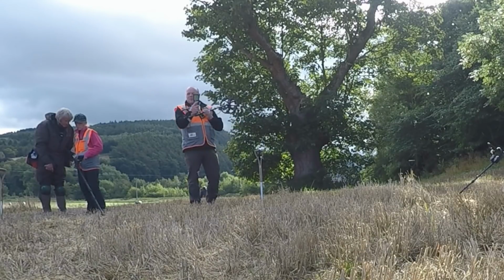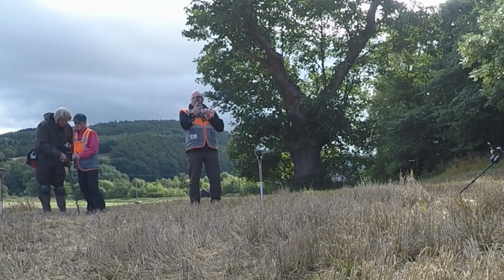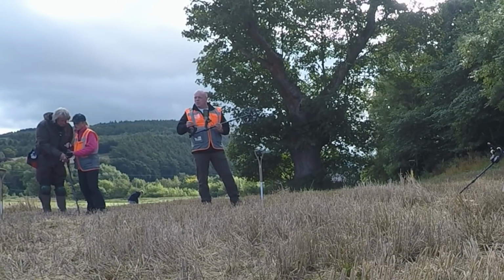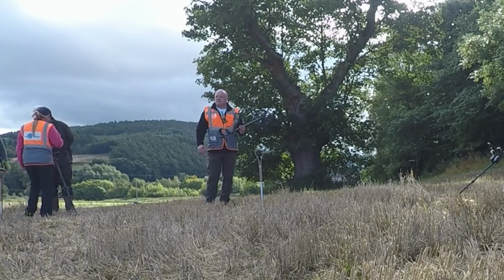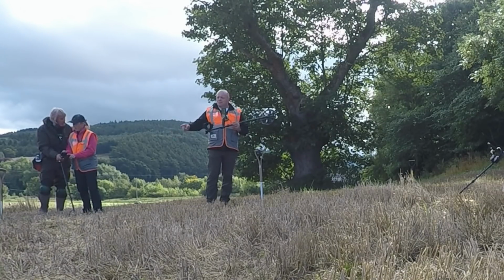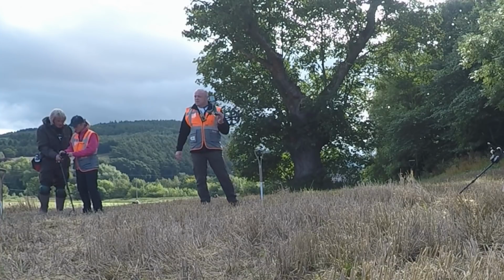The tracking you're talking about, which is the little tracking icon. If you double press that, if everybody goes into the ground balance screen just now, so you're getting the little detector, which is the second notch, and then you don't need to ground balance. Everybody should be reading 0, and what you've got to remember about ground balancing is very important. If you ground balance in one particular field and you switch the machine off and you leave it for 7 days and you're out the next Sunday and you go into a field, that will still remember your ground balance from the last time. What you can do is do an auto ground balance, or you just manually take it back down to 0, factory 0, and that's it.